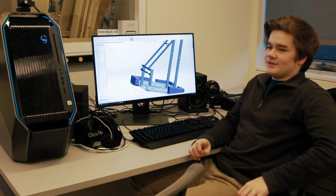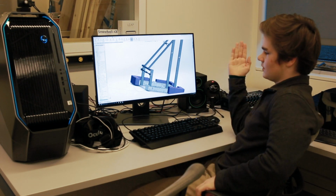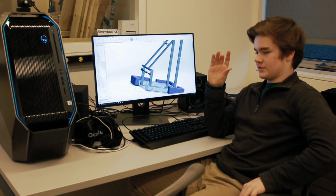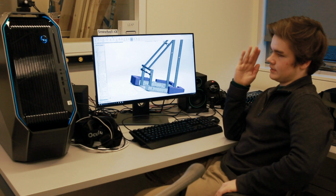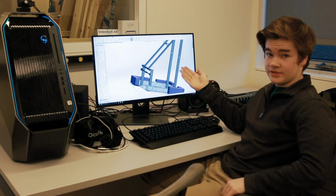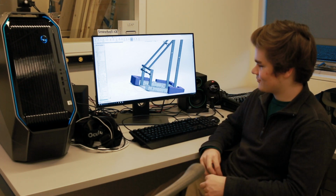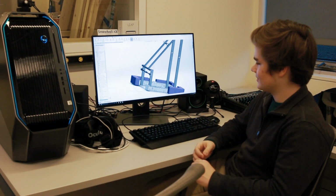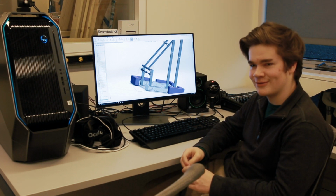Well, we originally wanted the entire conveyor to move up and down, but we're running into some issues with intaking the ball into that, and also different heights with our hatch panel mechanism on the front. It would interfere. On the front, we're planning on using a roller intake so we can make it wider and it'll center the ball.